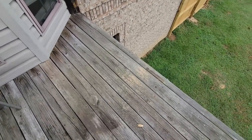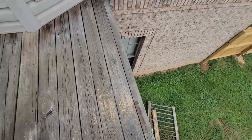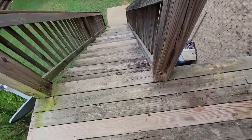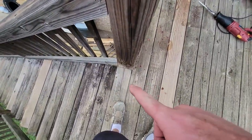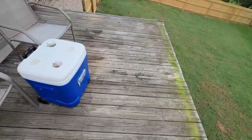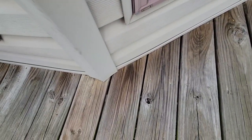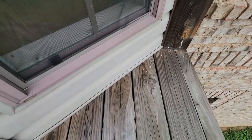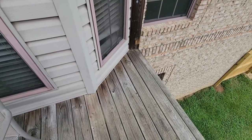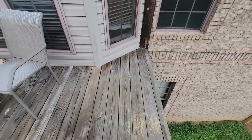and replace them. So it appears this one on the end was ripped, so it's about half the length of the other one beside it, and it appears that they started the deck on this side with the big board here and running all the way down to the last end where you barely see it. I should probably do the same, because I'm looking over here, I'm going to have to cut angled cuts to get underneath there up to the house. I'd like to have the same angle there. So I could just lay the old board onto the new board, draw a line, cut it, and bring it back out here. Yep, I could do that. That's what I'm going to do. Okay, let's do it.